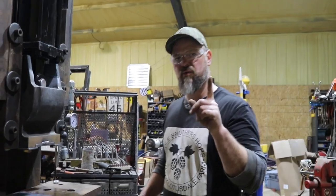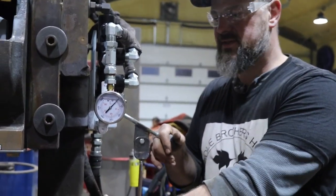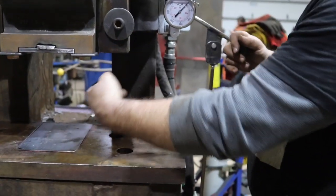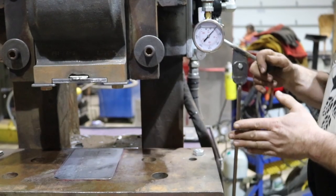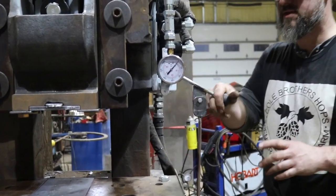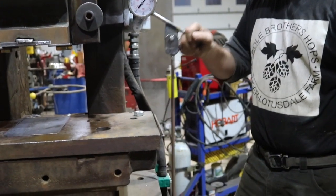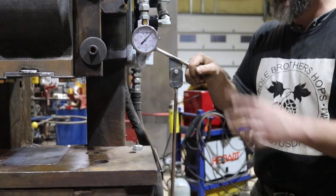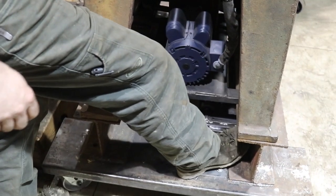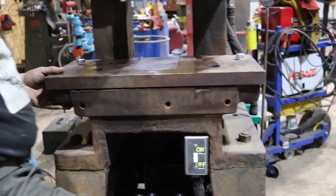Let me point out the control features. The great thing is the H-frame rigidity of this press. I plan on working metal mostly from the front, but sometimes you may want to come through the side. If I come from the side I'll use this lever — pushing it down makes the ram go down, and this pops it back up. If I'm at the front, I can use this foot control here, which presses down, and then I come over and hit it up.